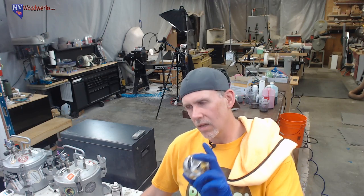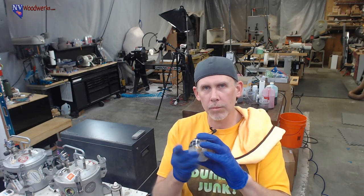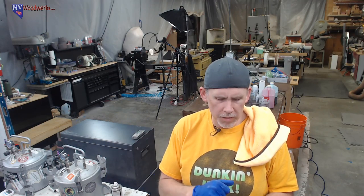My thing is, as long as you've done proper sanding, polishing and everything, you've gotten all the scratches out, and then kept going with the buffing wheels, you really shouldn't need 50 different steps. I go through all the grits up to somewhere around 2000 grit, and then Tripoli, white diamond, and then some final polish. That should be good enough. You shouldn't need anything higher than that.